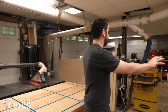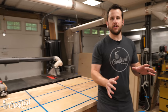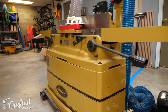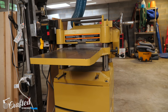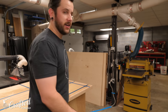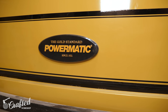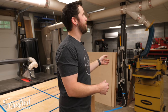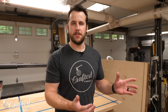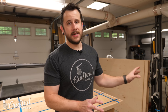I've got what I call the triangle of milling — the jointer, the planer, and the table saw. When I'm milling rough lumber those are the three tools I use most: I start on the jointer to get one clean edge and one clean face, move to the planer to get the other face parallel and cleaned up, then finish on the table saw to rip it to width. These are the Powermatic PJ882HH jointer and the Powermatic 15HH planer — both helical head. Upgrading to helical head jointer and planers has been a total game changer in my woodworking. Highly recommend both of those machines.